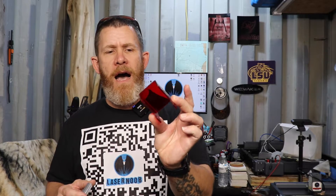All these lasers come with covers on the laser head. I live in Florida and I do a lot of work with basswood, which always wants to warp because it's so humid here, so I use honeycomb pins to hold my wood down — and these covers always hit the honeycomb pins. That's no big deal; I popped it off with two screws and I always have my safety goggles on anyway. I wish they'd make one that clears the honeycomb pins better, but it did its job. So far, all I'm going to say is it acted like a 10 watt laser — it cut through wood, it did stainless, it did all the things I wanted it to do.